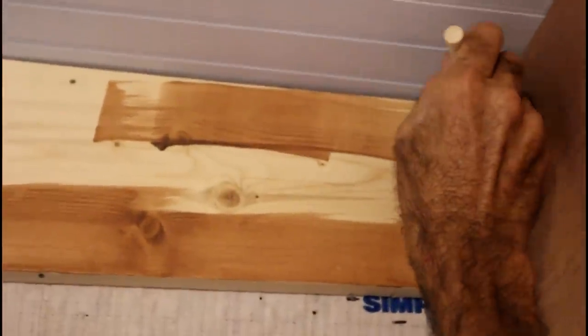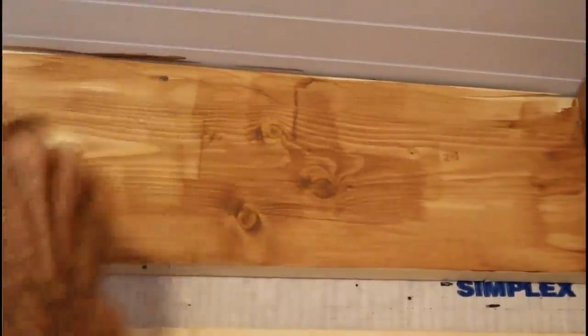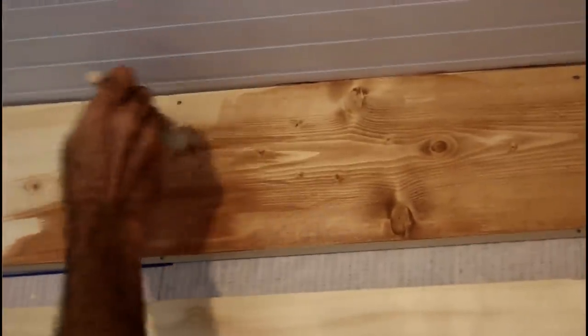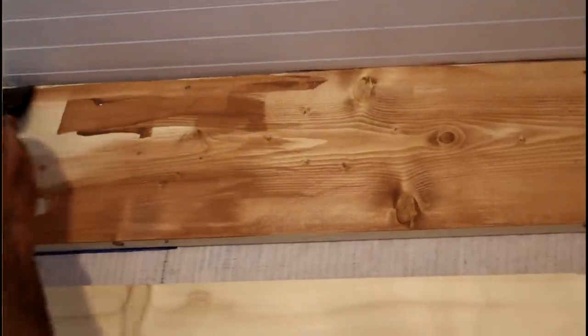I chose that because this room is kind of tiny and I didn't want a lot of heavy fumes in here. We do a lot of filming in here and it's in my house, so it's a very low VOC stain. Now I pre-stained all the boards on purpose. If I put the mortar in and then tried to stain the boards, the stain would get on the mortar. If I put the mortar in before staining, the mortar would stain the boards. So I decided to stain all the boards first — I learned that from watching guys on my construction jobs.